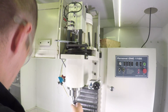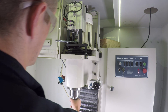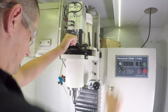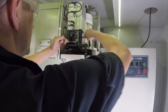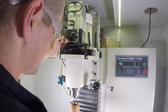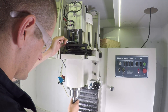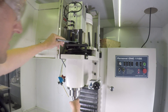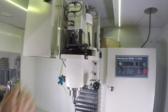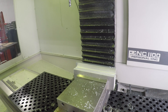A lot of times it doesn't take much once you get close. I can pull that out — that's too tight. I just backed it off a little and now it falls out closer. I'm fine with this. Obviously if you're using a tool changer, you need to be more concerned with ensuring positive tool release. Let's do that same cut again and prove that we don't get tool pull out — or prove that I eat my words.